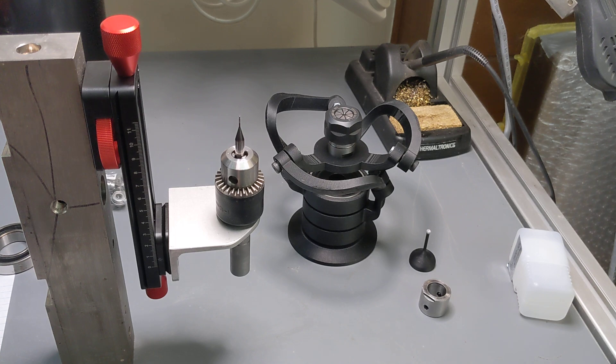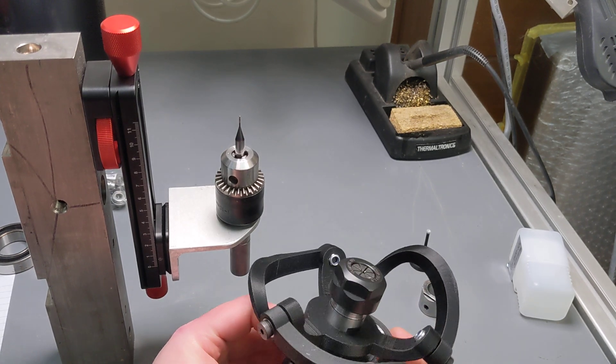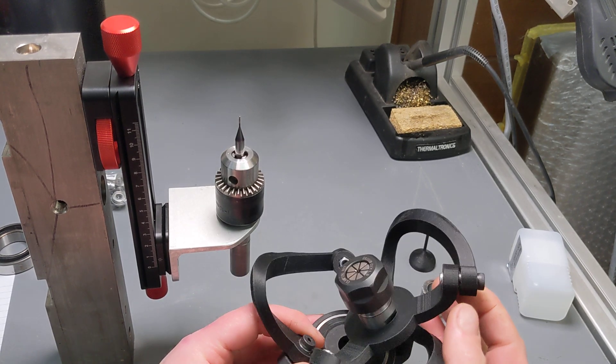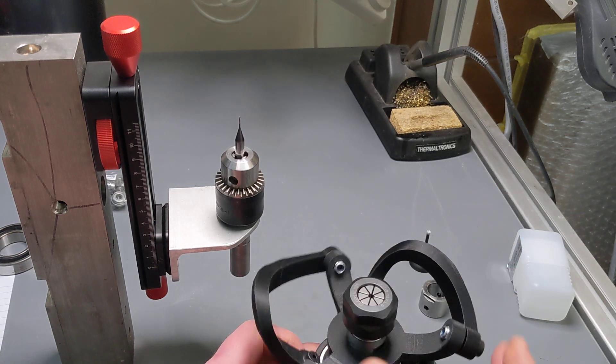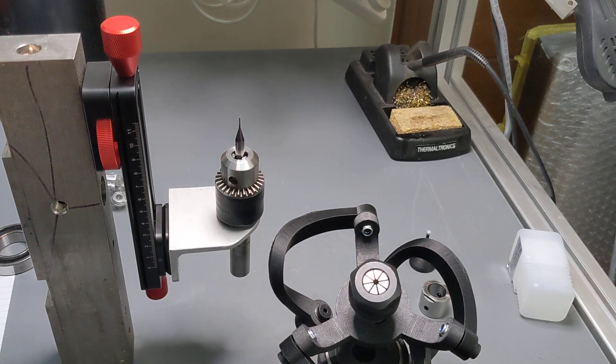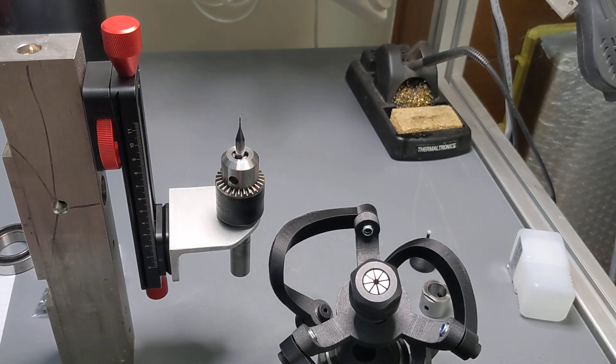To summarize: Concept 2 is boring but it works; Concept 1 is fun but it's awkward. The other issue with the spherical parallel manipulator is if you want to maintain a position and rotate it, it's very hard — you get lots of parasitic motion whenever you do anything. It looks cool, but it's very hard to just rotate around a bit. So: polar manipulator for practical microscopy, or spherical parallel manipulator for fun and weird. I have good AliExpress cheap sources for bulk bearings and stuff, like $9, so I can make it so it goes together cheaply from a bunch of parts and just provide a parts list and a 3D print list.